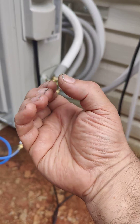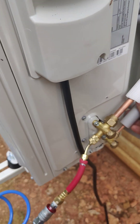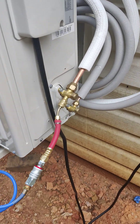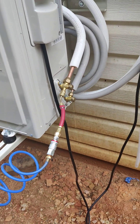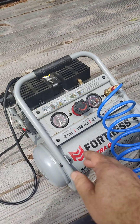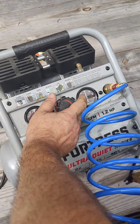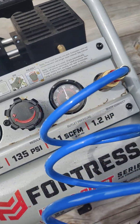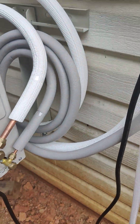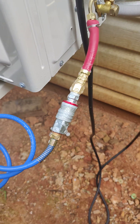That's why you want to use pressure — pressure will force the crack open and show you leaks around your fittings. In a perfect world I'd have a 3,000-pound nitrogen bottle, but I'm not going to buy or rent one. I do have this compressor, which goes up to 135 psi. Right now I've got 120 psi going into these line sets, which under normal conditions will see up to 300 psi.